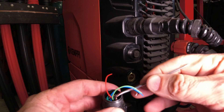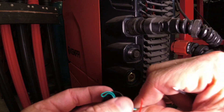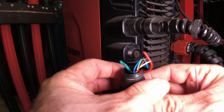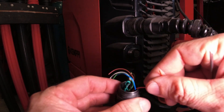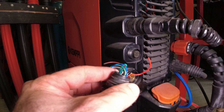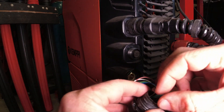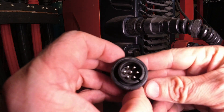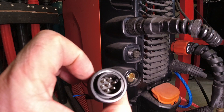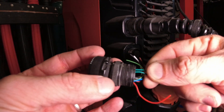I've gone ahead and taken the plug off the old torch — hopefully I can show you what's going on here. There's a looped wire, which was actually looped from factory. For me it was looped in here already. Possibly, depending on what torch you have, or if you've got an aftermarket brand with a plug, it might be looped at the switch end. Inside here we've got all the pins, marked alphabetically. What we want to jump is pin F and pin G.